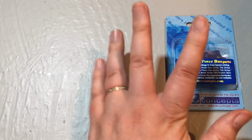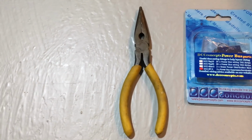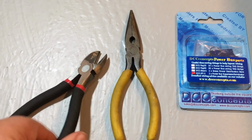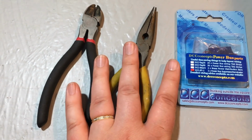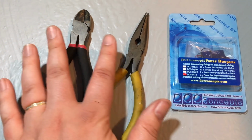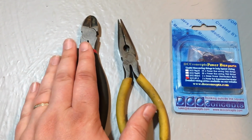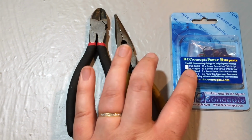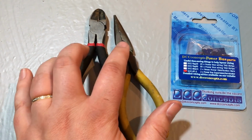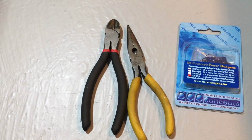So what I'm going to need to fit these underneath the baseboards into the existing wiring, I've got a pair of needle nose pliers, wire snips. I'm going to use these two just to bare the ends, and actually my power bus goes through an awful lot of connector blocks. Now I know a lot of people go, oh, terminal connector blocks, really bad idea. Well, actually they do work out for me, and it does mean that I can fit these relatively easily, and the whole point of them was that I use a hub and spoke method.